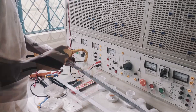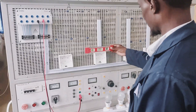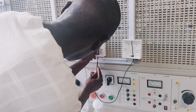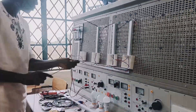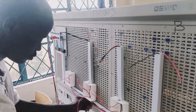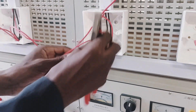It has a residual current device that is even more effective than a normal miniature circuit breaker. I'll start by mounting the trunking components. These include the patresses and I'm using deep patresses but single. After mounting, what's next is to draw cables. I'm drawing the neutral then the live cable. Remember, while drawing cables you should be sure of how many cables are supposed to pass through a given channel. For this case I have two two-way switches sharing a two-way two-gang switch for the two-position operation of the first two lamps.